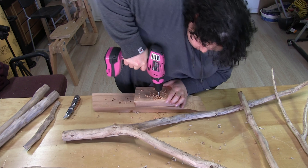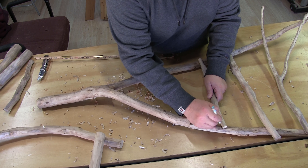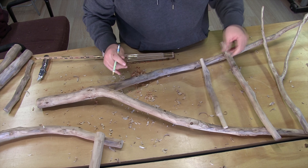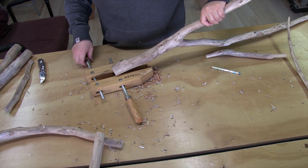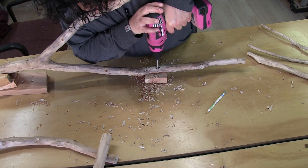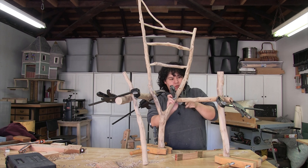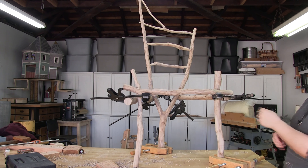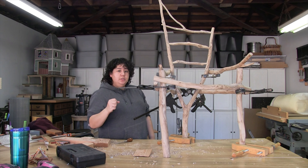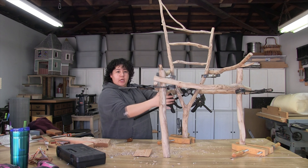To help match my drill bits, I drilled some holes in a piece of scrap wood that I could use for fitting. I could have measured where the placement was going to go, but I didn't. It was much easier just to eyeball it, and since this was an organic form, it really didn't matter much as long as it looked good. With the back dry fitted, I used some quick clamps to help me lay out the form. I decided that I'm going to drill a hole through both of the members, sink a dowel in between the two pieces, and glue it in.